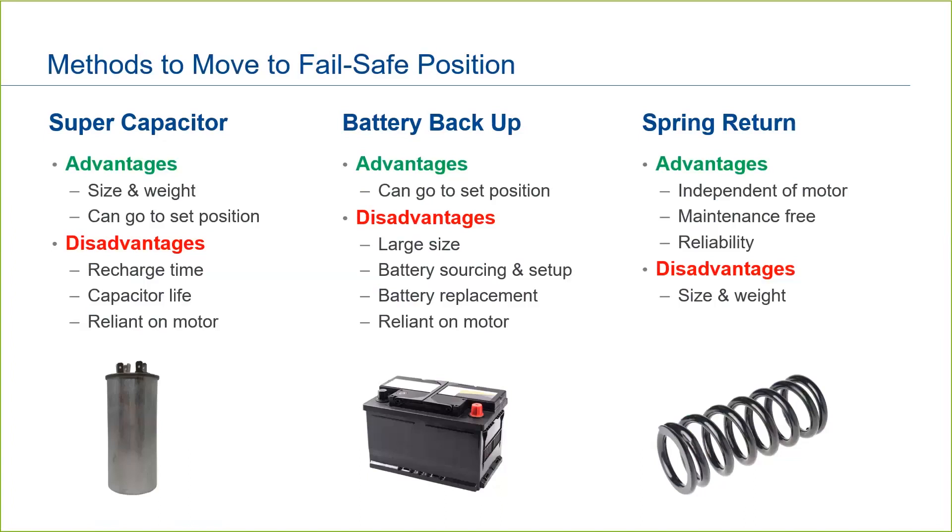Mechanical spring return is what we believe is the best way to achieve failsafe functionality with an electric actuator. Many people are familiar with the reliability and robustness of the Bettis pneumatic actuators with spring return — think of that reliability being coupled with an electric actuator. The one downside to this technology is it does tend to be a bit heavier. However, with the Bettis RTS and Torque Plus actuators from Emerson, the designs are still very compact, with great success in tight applications. The spring is completely independent of the electrical system and motor, giving us a totally separate drive system — mechanical and electrical. In some extreme situation with a catastrophic failure to the electrical system, the actuator will still stroke with the power stored in that spring.